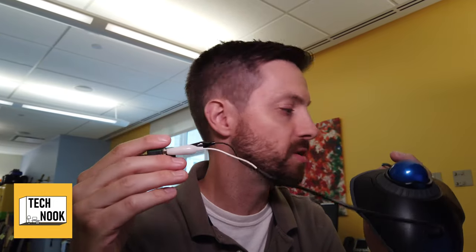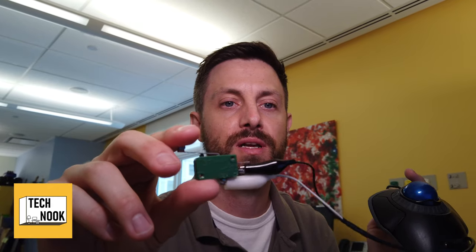And then there are functional hacks that I've done. One involved taking apart a computer mouse and making that switch adapted, at least for the left mouse click. So this is a trackball mouse where a user can just use the trackball. And then I put in a switch port that you can plug any switch into. This one is just a little lever switch that one can use now as a mouse. You could plug in any other switch as well if you need a bigger switch or something more like a sip and puff switch that can be used now as a left mouse click.